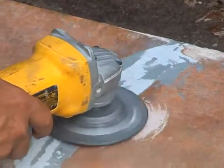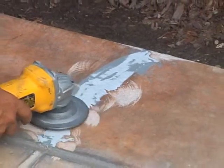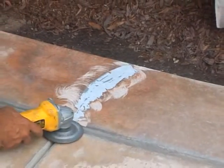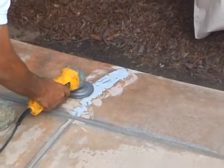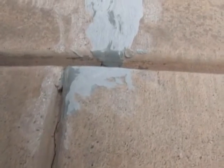After the epoxy has cured, the filled crack should be ground with a diamond grinder to ensure that the surface is flush. Fiberglass and PD resin can be added over the repaired cracked area. All concrete substrates should be assessed to determine if additional expansion joints should be cut into the slab to help control future movement cracks. Cutting into post-tension slabs is not advised.